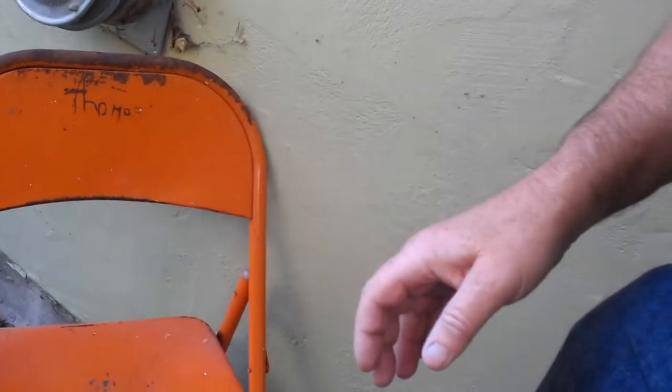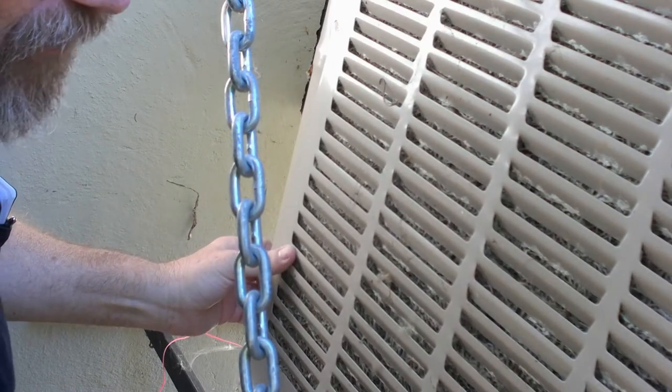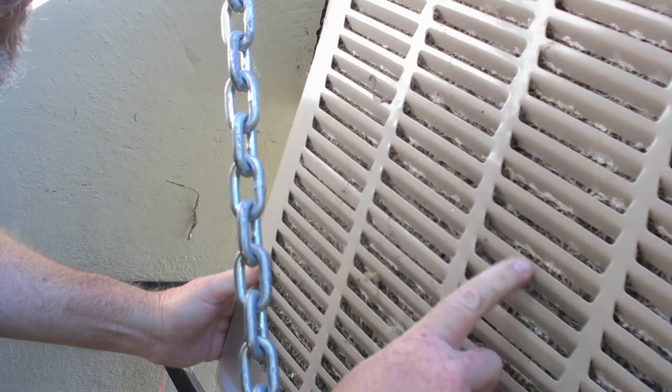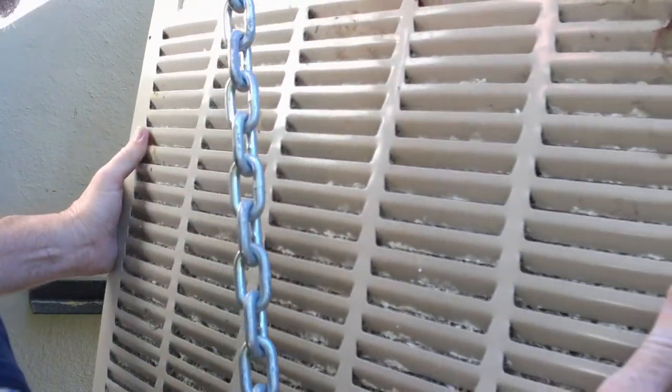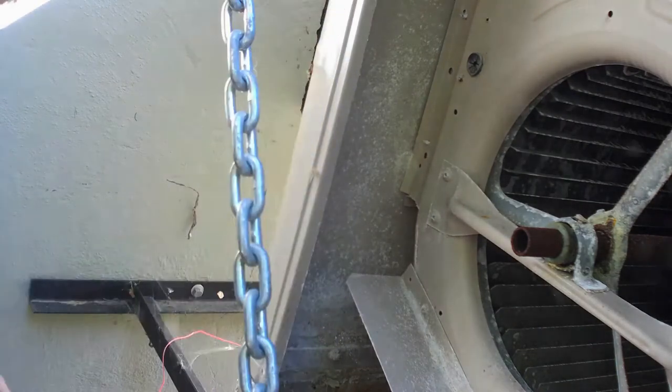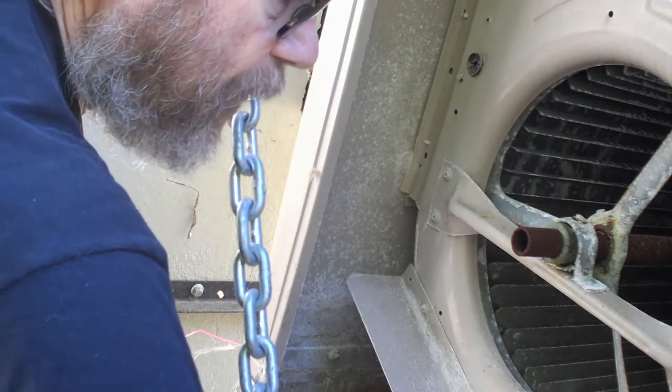Let's get going on taking the cover off. I also got myself a chair because my feet don't always work well. When you're working on your limits, you've got to be prepared. I would have done this yesterday but I knew my legs wouldn't hold me on a ladder. I've got a couple of ladders set up so I don't have to move them around. This panel has got a lot of white scale in it and I'm hoping running white vinegar in here will help cure that issue. I also got a paintbrush to clean this up a bit. I'll probably run the white vinegar, then drain the whole thing out to get a lot of that cleaned out.